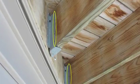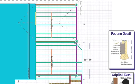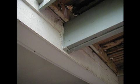Make sure that there are skewed joist hangers on these angled joists. Here's another bumped out area — the whole back of the house is bumped out. That means all the weight is on the cantilever. It should probably have a beam right here to carry all the weight that is overhanging the foundation wall. And here's a really bad idea — just hanging right off the cantilever without even a ledger.